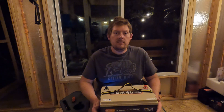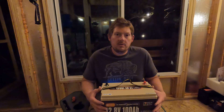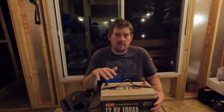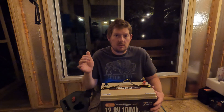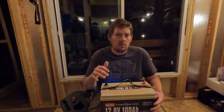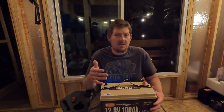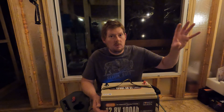These batteries are made with grade A cells and should last 10 years with at least 4,000 recharge cycles. They feature a C7 upgraded battery management system and can produce a surge amperage of up to 300 amps. The low temp cutoff protection is built into the BMS — below 32°F they stop charging, and won't resume until reaching 41°F. Below negative 4°F they will not discharge at all. Keep this in mind when deciding where to store and operate them — upstairs will be a little warmer than downstairs.